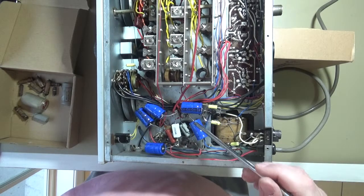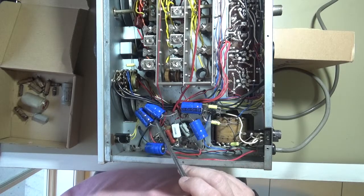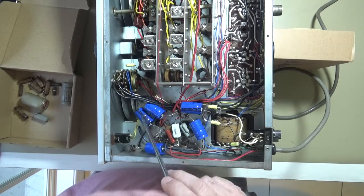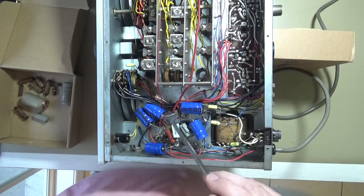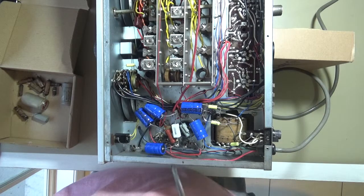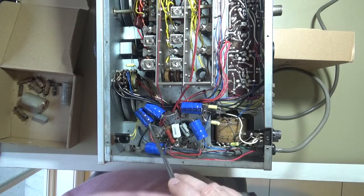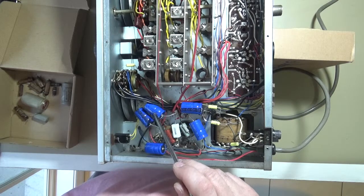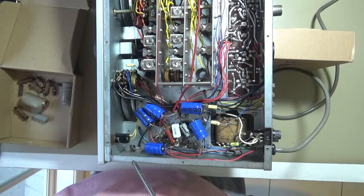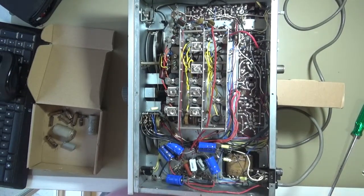The other thing that I did find, because this radio has got the two voltage regulators installed, there's actually two additional capacitors. I didn't actually notice them previously because I just thought they were the ones for the chassis here. But anyway, luckily I'd ended up ordering additional capacitors, a few spares to keep in the kitty. So I had them available to actually put in. So no other capacitors down below here to be replaced.